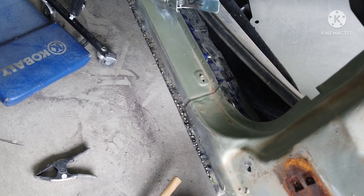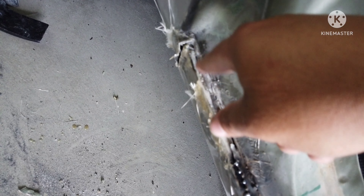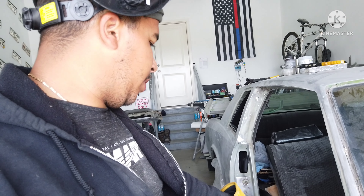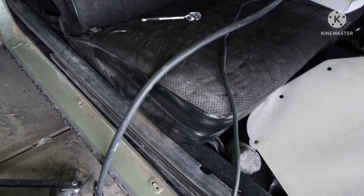Still not perfect, but I think it looks a lot better than before. I'll still add some more spot welds all along here just to make it a little bit stronger, then smooth it out with the flap disc and put a seam of fiberglass filler on it. I'll still need to sand right in here and add a few spots. But overall, I don't think it's that bad — my second attempt at it. Really, it's my second attempt at MIG welding besides little practice pieces.